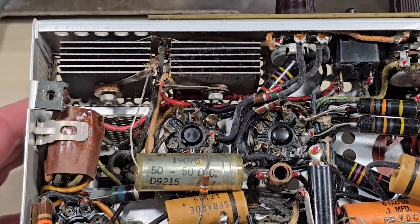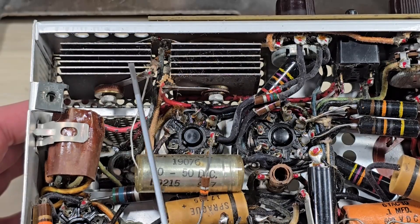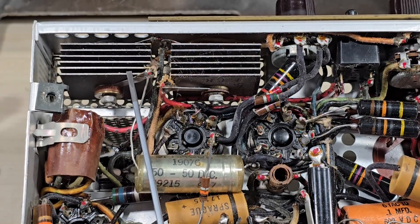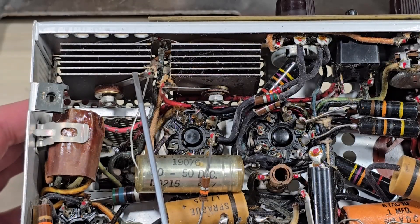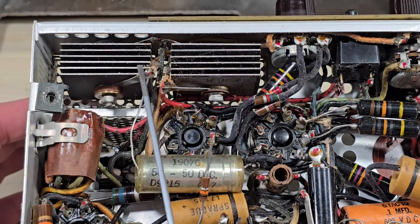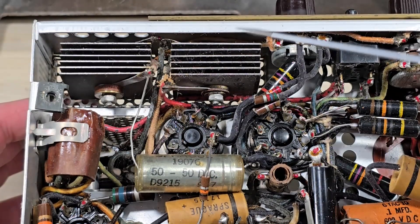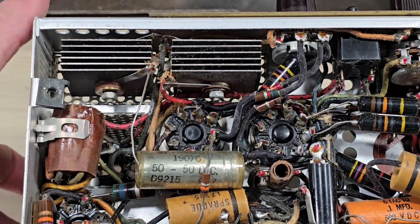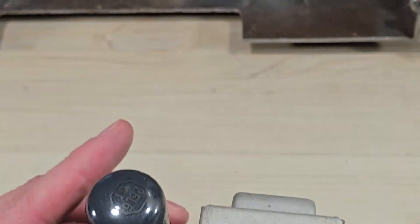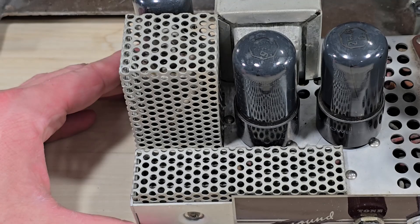Check this out — there's a pair of selenium rectifiers. This came from that short period of time between the vacuum tube rectifier — for example, you might have used a type 80 or a 5U4 here previously — and that time when silicon diodes took over. We should note that this is a challenging technology, evidenced by these huge heat sinks attached to the selenium rectifiers, and in this particular case there is a cage in which the heat can be dissipated.